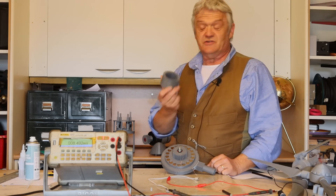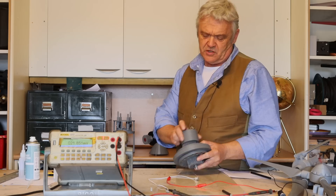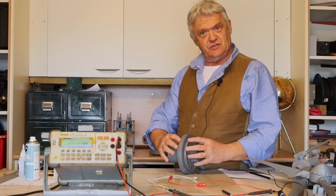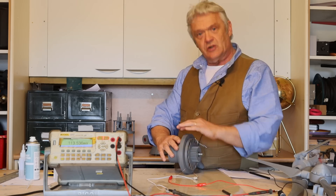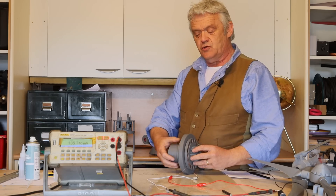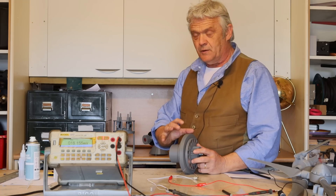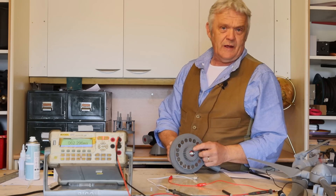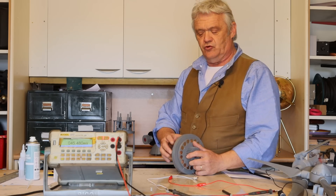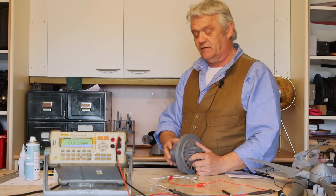To give this a go, I've made this connector — also available in the STL files — and it just goes on to one of the cogs. I've tried to make this as adaptable as possible. The two discs aren't rigidly linked; they're held by the magnetic lock between the two series of magnets, but they will be able to slip. It also allows you to contra-rotate — you could drive one one way and the other the other way if you wanted. If you don't want that to happen, you'd have to create a plug where the bearings go so the axle goes right the way through, which would lock the two discs, but you can do that as an add-on.